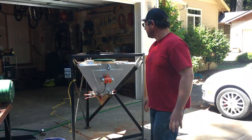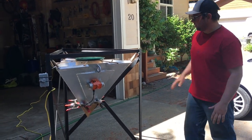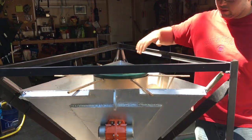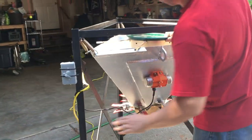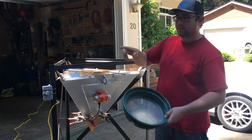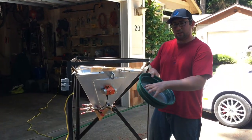Then I'm going to run it through this homemade concentrator and screener — it's a two-in-one. But first I'm going to screen it through a 30 mesh screen inserted into here, and this whole container vibrates. I'll take off the bottom to get the fines out, and then we're going to rerun the oversize to the hammer mill to grind down and free any more gold that might be in the 30 mesh plus.